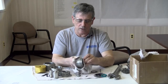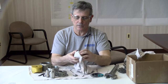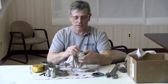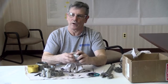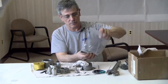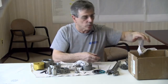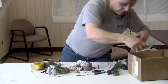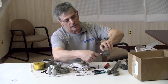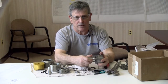I would use small files — tools that debur — and I can debur the burr just a little bit, lightly going around the edge from running back and forth, maybe rubbing the side. Sometimes they get like a side wear that'll wear a burr off. And you should have no problem reusing the detail unless it's really damaged and it doesn't look like it's going to hold a seal or anything. But the majority of the time, these aluminum details have hard coat surface treatment — a hard coat anodize — to help with wear on the moving items.